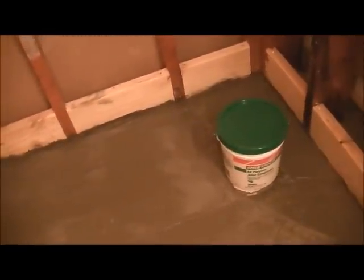My customer bought a new shower valve, so tomorrow two things will happen in succession. First I'll change out the valve — the sweating of the pipe and all that sometimes drips solder or sparks, so I don't want to put my pan liner down first because it's rubber and it'll burn right through. The valve work gets done first, then my shower pan will be put down. Then I have to wait overnight for that to dry again before I can start putting my wallboard up or putting tile down.